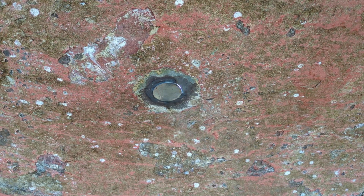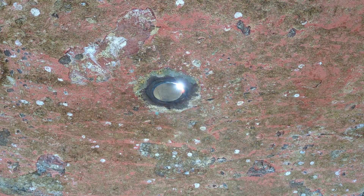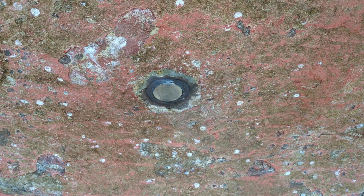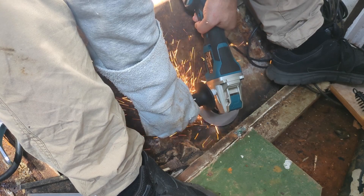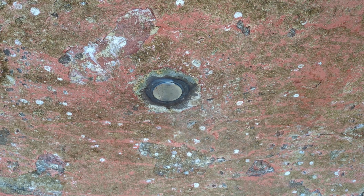Slowly but surely the gaps around the plug closed millimeter by millimeter, securing the steel plug in place permanently — well, at least I hope it's permanent; replacing this isn't going to be any easier than getting it fitted in the first place. Welding and hammering seems like fairly simple work, but if there was even the slightest suspicion that a part of a weld had any voids or slag inclusion, we would grind down that weld to be sure it was metal all the way through. Better safe than sorry after all.